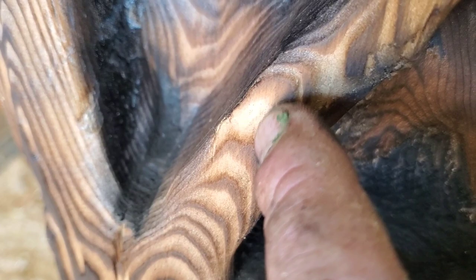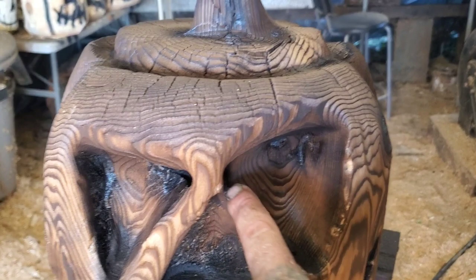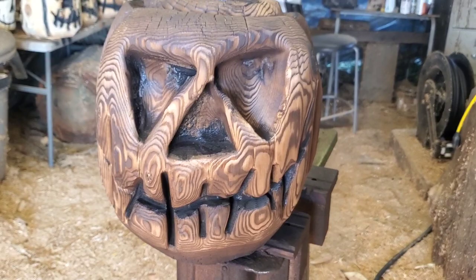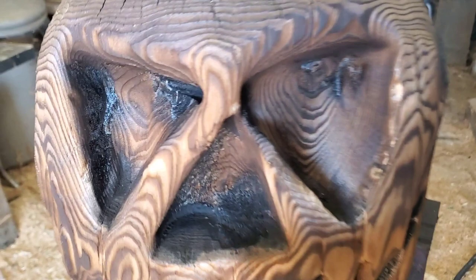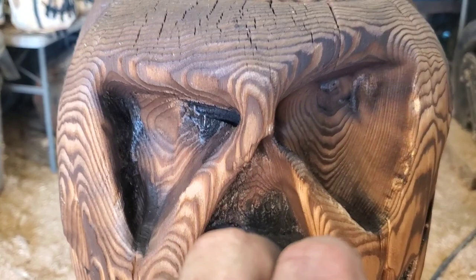It's bumpy. I thought I saw one, but anyways, you can see here, you're starting to see the grain pop. This is human error. I don't care. It might be a softer spot in the wood, right? Grain goes this way. But anyways, what I got to do now is spend another half an hour cleaning this, because the brighter that you get that white there, the more you're gonna see your wood dye color, okay? You'll see the more it will pop.